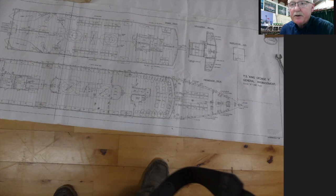What choice did I have? So how do you build a working model ship? Or more especially, how did I build the 1 in 24 scale King George V? Because this is not normal. It took the month of August 2017 to plan the project and check the drawings. The length of the drawings was 1% out on the small side, the ship being 270 foot 6 inches. The model would be 11.27 feet by 1.33 feet beam. So that 1% always to be taken into account.